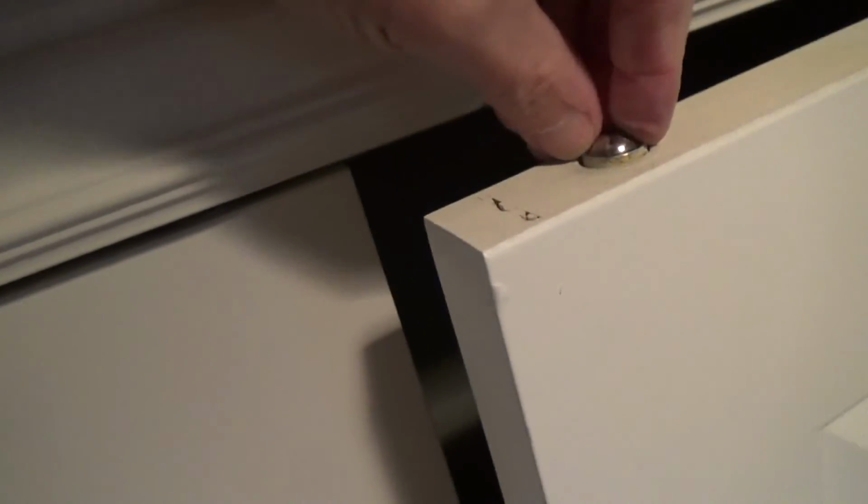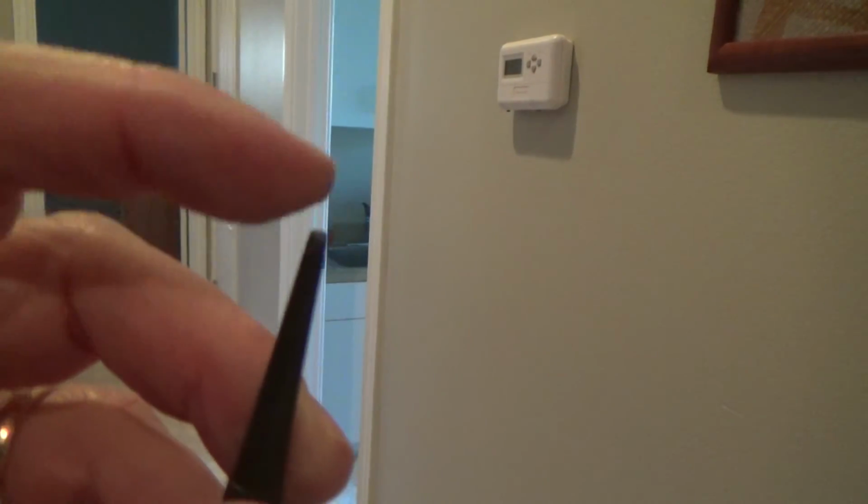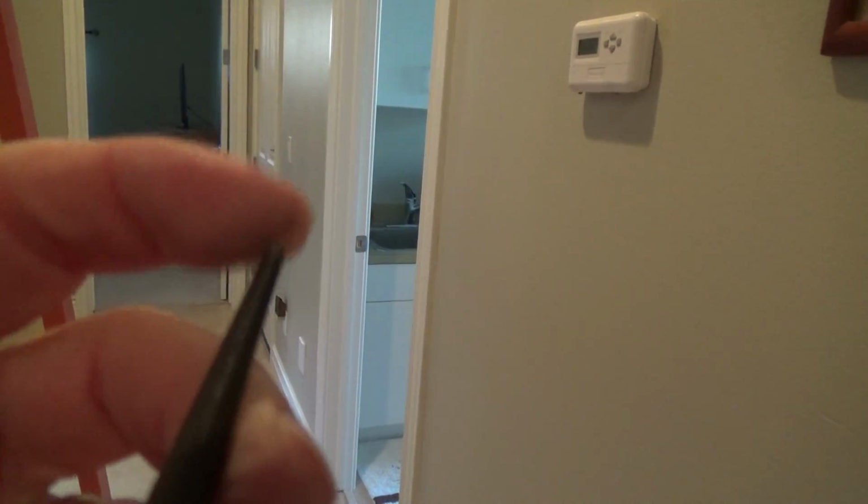Trying to just do it with my fingers, and I've gotten it down a little bit lower. See, it's barely missing. I can't get that anymore until I get my hammer up here and my nail set. And I got just a crummy nail set here. See, it's all rounded on the top. It should be flat around the edges and indentated so that you take it on a nail and then it holds it on there. Well, mine, I banged it on certain things and now it's all worn and stuff. I really need to get some new nail sets, you know.